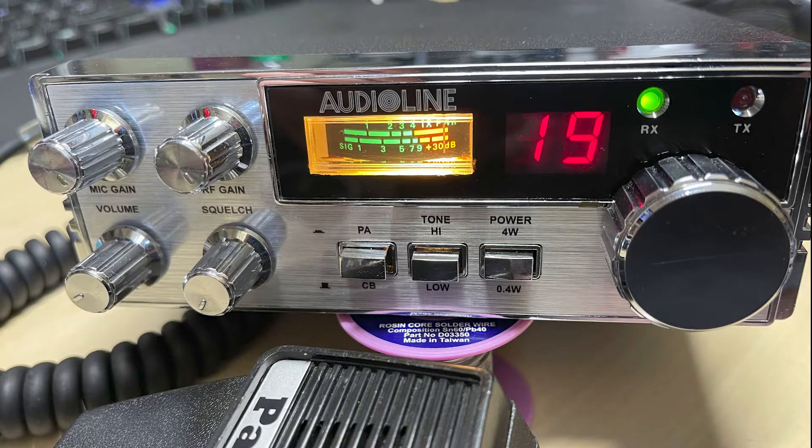So here's the radio as it finished: new decal, replacement meter, mid-band sorted out, coil in the IF sorted out, dirty switches and controls cleaned, VCO broadbanding done, alignment on transmit and receive, and a really, really good clean. I think that's transformed this radio from what was possibly the dirtiest radio I've ever seen into something that somebody can use. Anyway, thanks for watching and we'll see you in the next episode.